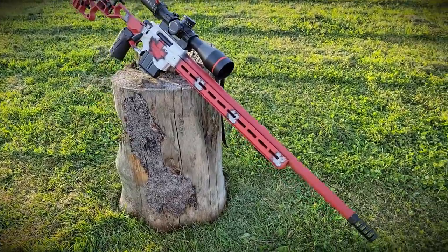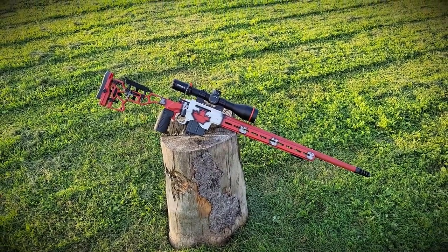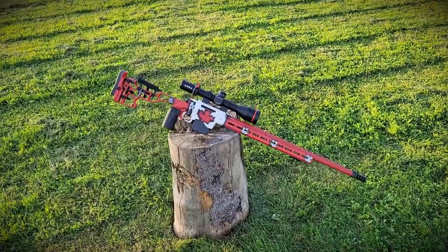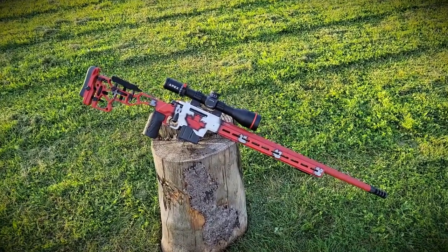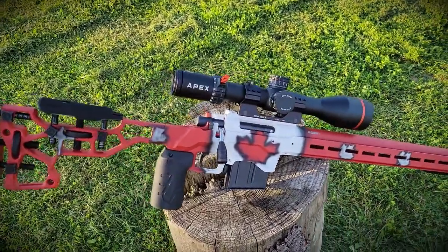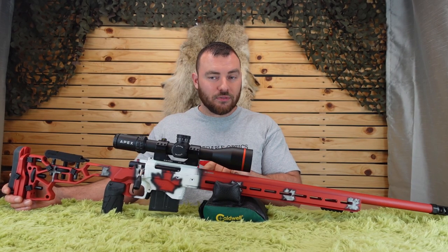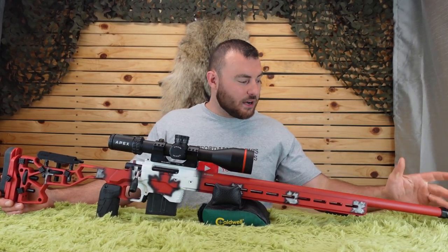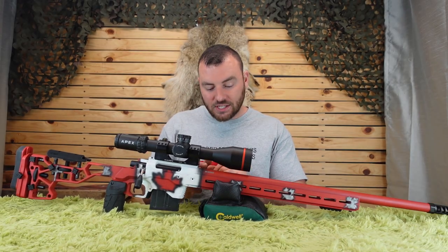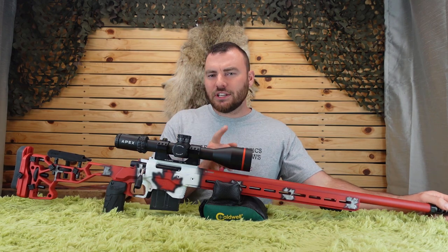If your rifle doesn't have good stress relief, your cold-bore first shot will be in a different place than the rest of your group — a typical symptom of poor heat treatment. These barrels are made of 416R steel with a 27 to 28 Rockwell hardness and are hand-lapped to 20 microns. Not every custom barrel company hand-laps their barrels. They can be chambered and threaded for around $625; however, on this build, chambering was handled by our gunsmith, EM Precision.